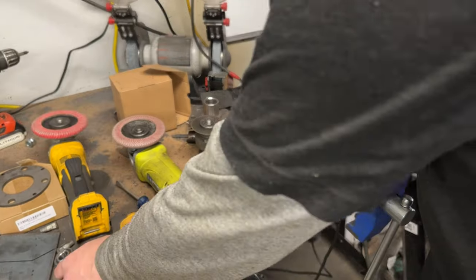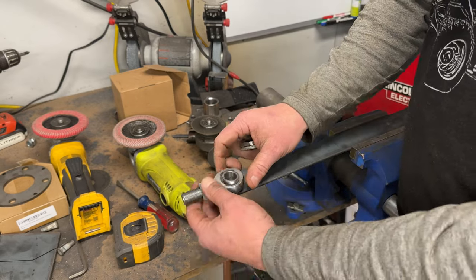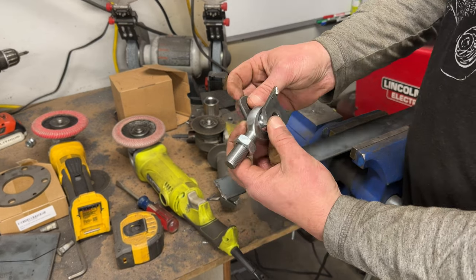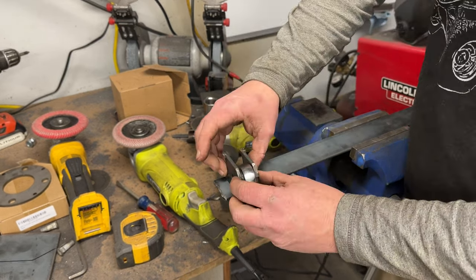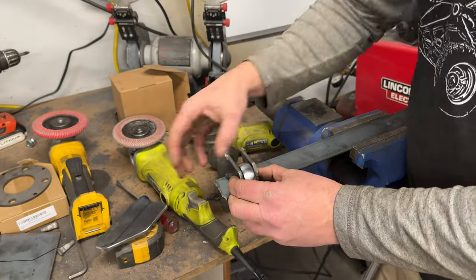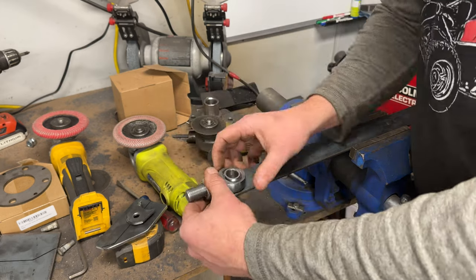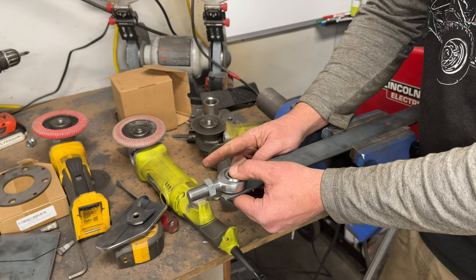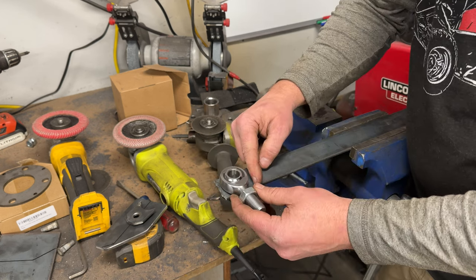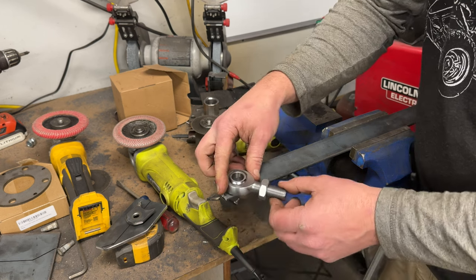All right, so now we need to make the lower forward mounts, and they're just gonna be boxed in. I've got 1.5 inch flat bar here, and to give you a visual, they're basically just gonna sit on a plate, which I've already made. I'll show you that here in a second, where it's gonna go. And it's just gonna hold our heim in place. Now, we can't make it unless we had 2 inch flat bar, which I only have 1.5 inches. So we're just gonna rotate it, and I'm gonna give some clearance for flexibility,